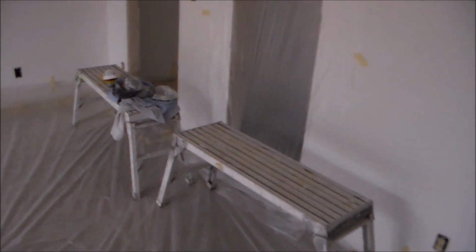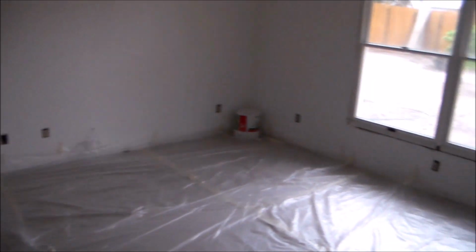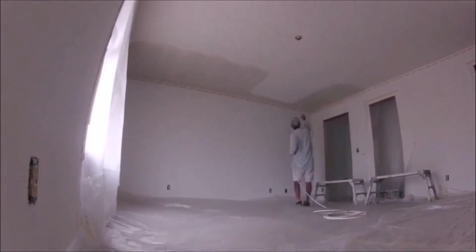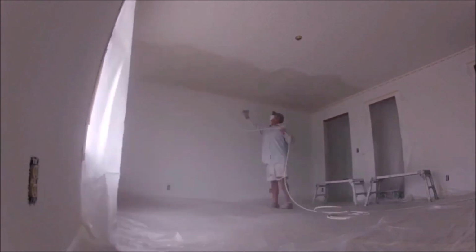All right, so I do want to put one very important disclaimer out. If your popcorn ceiling was applied before 1982, you need to get it tested for asbestos. There are some home kits that you can use at home, and I have some of those in my Amazon store, so check that out. I'll leave a link to my store down below in the description of this video. Next, you want to wear some old clothes, an N95 face mask, and some safety glasses, and probably a hat because you might get a little dusty.